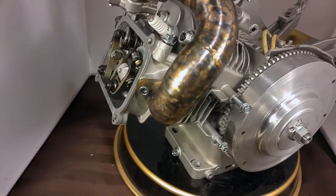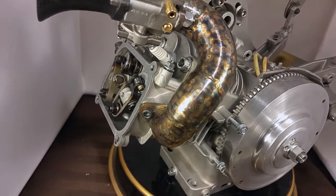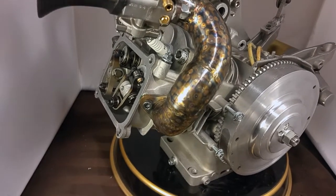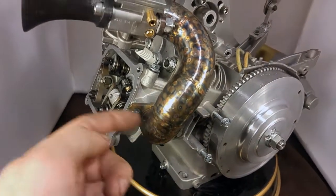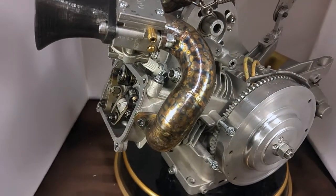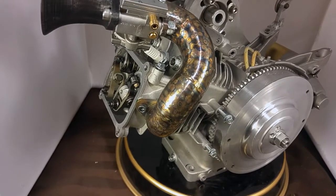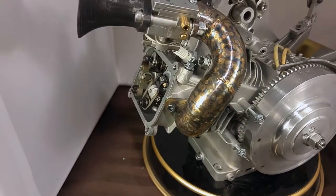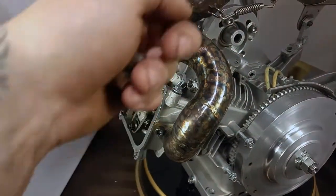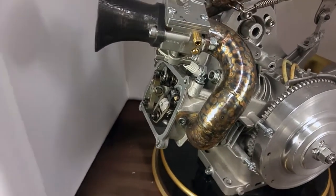I have fabricated a manifold. The thing is, I realized that these little engines have all these performance parts, but the racing manifolds they have are not calculated at all. They're actually a performance hit a lot of the time. The only exception is there's this one long one that loops around and brings the carb up somewhere, but this needs to be pretty long.